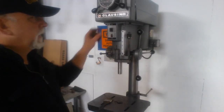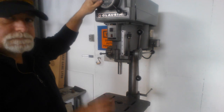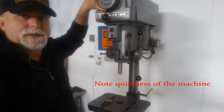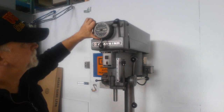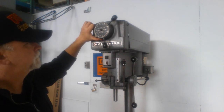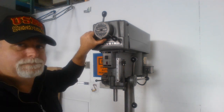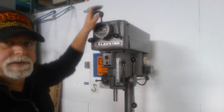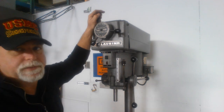Let's fire it up and see how well it runs. Here we're at 500 RPM — everything nice and smooth. We're going up: 590 RPM according to the dial, then 1,500 RPM, then about 2,500 RPM. Full on: 4,500 RPM. If you had really small drill bits you might want to run at that high RPM, but most everyday drilling would be between about 500 and 1,500 RPM.